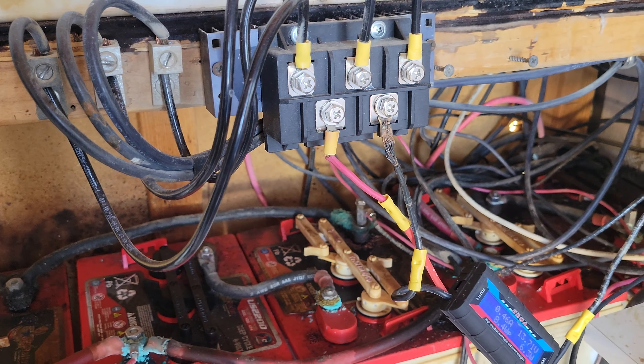You could do this and then take the positive and the negative into the solar part of a controller. But if you have the three wires coming in from your hydro or wind, you can go right into the three wires here in the center. These two outer ones are for dump load or resistor. What that does is if your input exceeds what you really need, it sends the extra power out to the resistor and burns it up as heat. Everybody asks why not use that for a water heater — I have a propane instant water heater inside the cabin, so that's plenty of hot water for me.